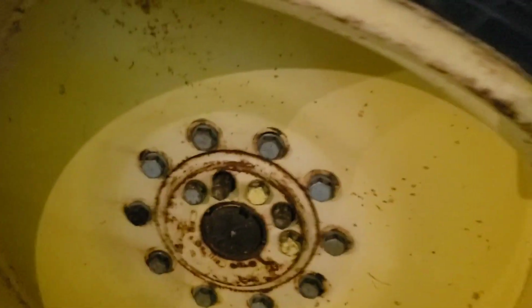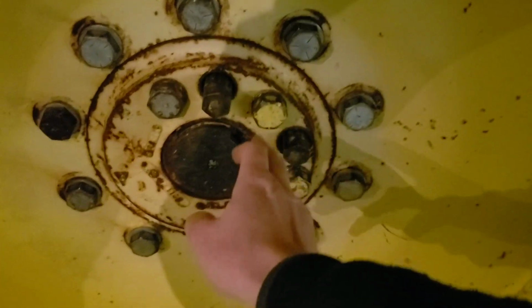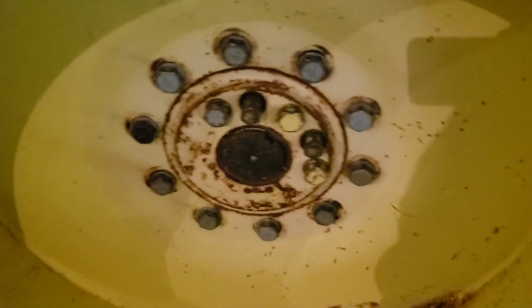So go ahead and remove those inner bolts I just showed you. Then remove these bolts, or take them, they're all just like a thread left. Then you start rattling on these 2. We use a 1-inch impact, and those push this half of the wedge. There's a wedge here and a wedge here. This wedge here, and my fingers are going, that's the inner bolts. These bolts here are the other wedge. So one wedge pulls this way, the other one pulls that way. The pushers will push in on this wedge.